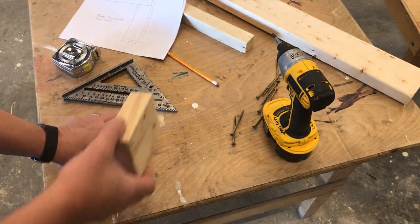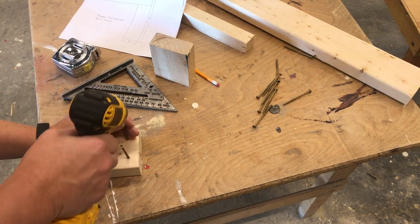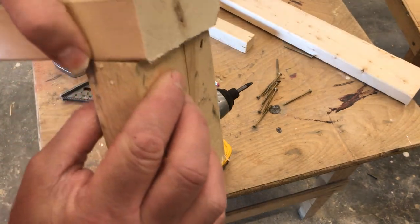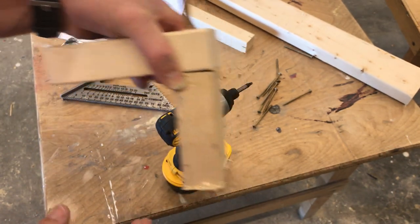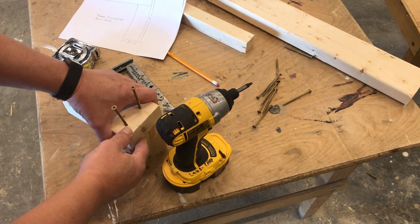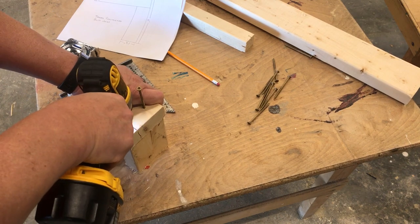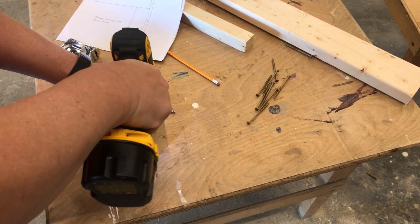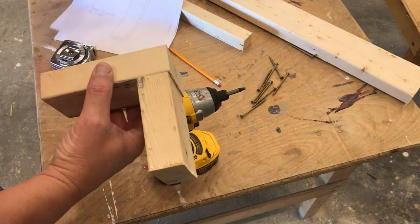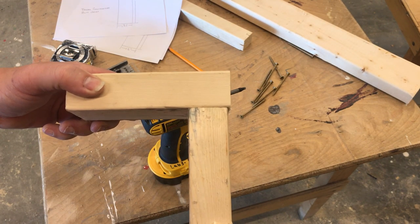In this case, I'm going to use screws to put it together. I'm actually going to pre-start my screws in the long leg — it's a lot easier than trying to hold them. I'm going to hold it, make sure it's flush on the outside. I'm also aligning it on either end. And now we have a butt joint.